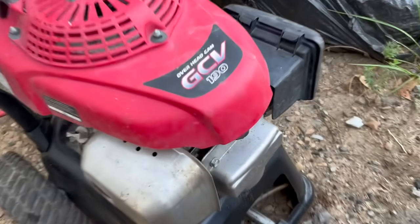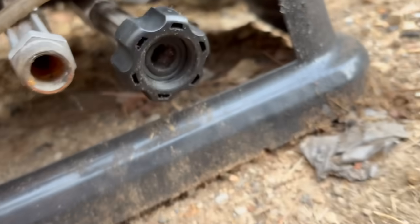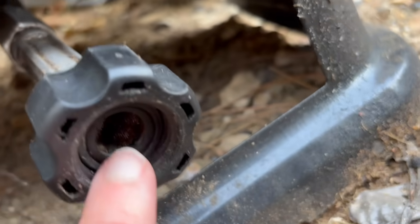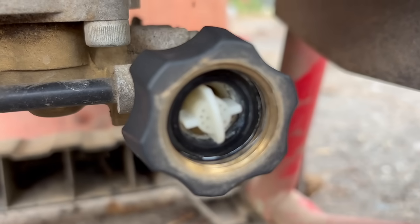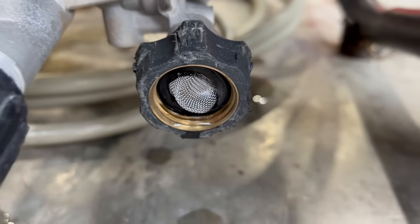If your wand and hose are good, next check this. The reason the pump went bad on this one was they all have an inlet screen inside where the water goes in, and this one was completely compacted with goo. Yours might look like this, or have a metal mesh like that. If your screen doesn't have debris in it — and hopefully you still have a screen there — believe me, there are many times people lost their screen out of their pressure washer pump, didn't realize it, and debris got sucked up into the pump and ruined it immediately.